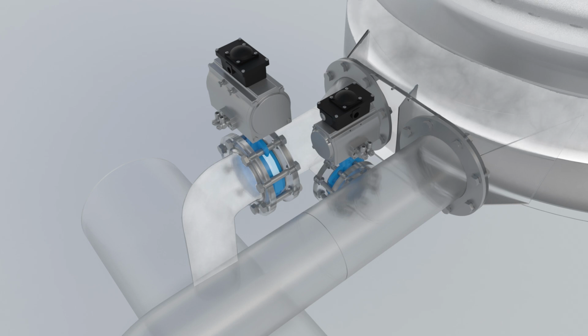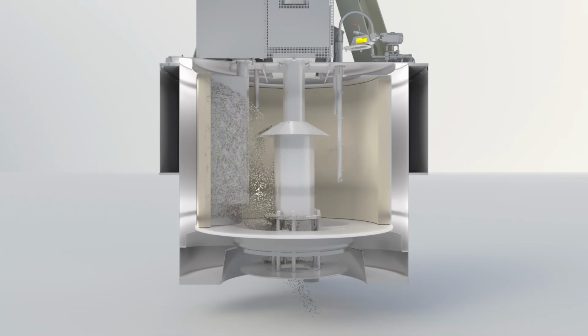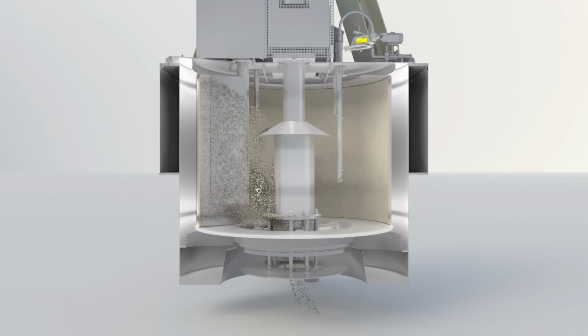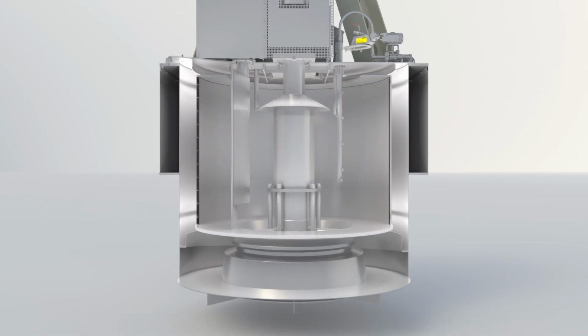The centrifugation phase is used to dry the sugar and to eliminate the remaining runoff. Once a safe discharge speed has been reached, the machine discharges the sugar from the basket in a single movement of its discharger. At the end of the working cycle of the BMA centrifugal, the working screens are washed, which is also considered white runoff, and this prepares the machine for the next cycle.